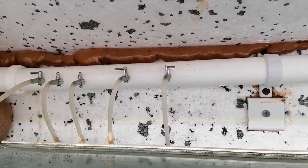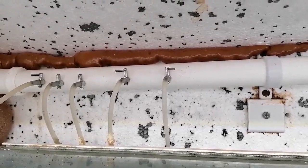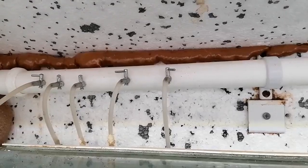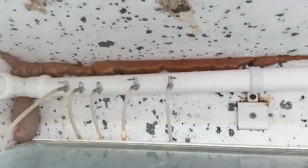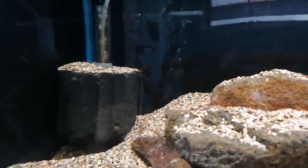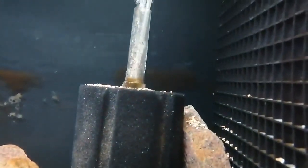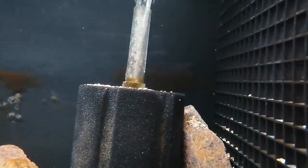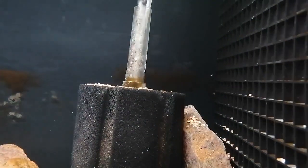My pump is only a low-output pump, but you'll be totally surprised how many sponges you can run off it. The reason for the closed-loop is that if you have long dead-end extensions, it's very difficult to get even air pressure. With a closed-loop, the pressure is equal all the way around. You then tap into it with little valves, dropping an airline in anywhere you want and connecting it to your filter.